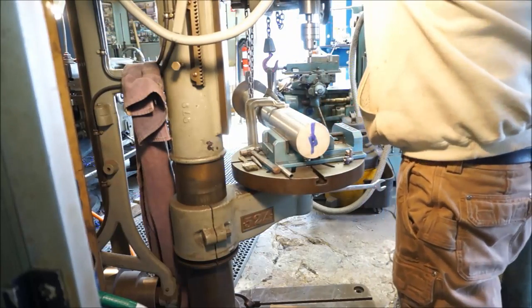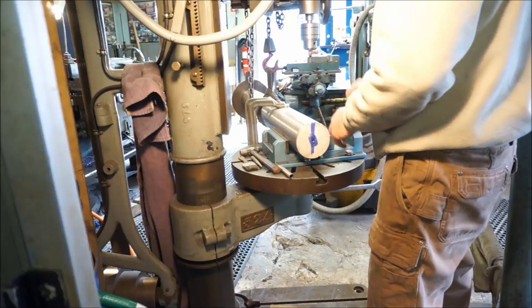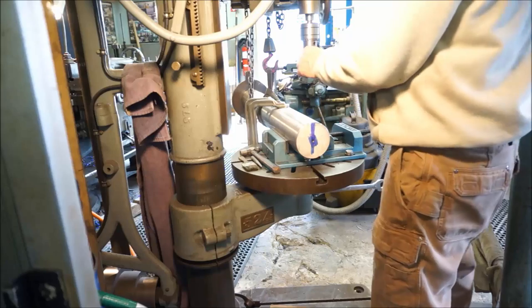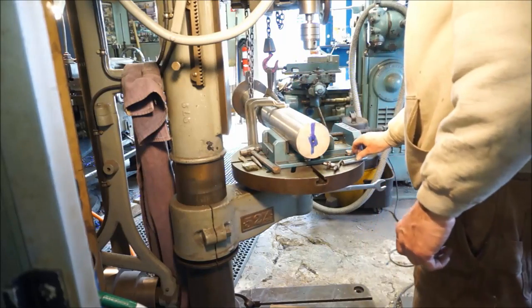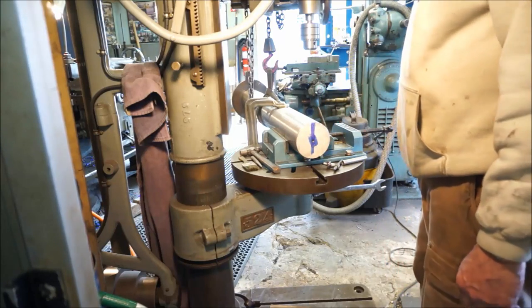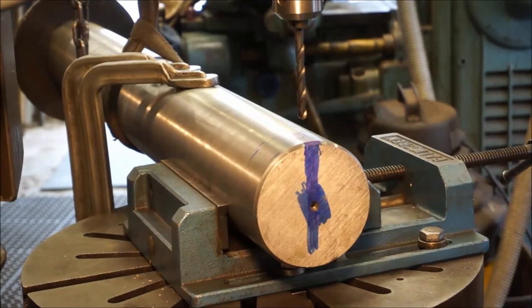And also, our spindle is going to be up in the air, and we're going to be sticking out here a little bit. So I'm happy with how close I am to that punch mark there. Go ahead, and we're going to get ourselves a long drill in here to make that first pass. I got to go hunt one up. Alrighty, I think we're ready to go here.